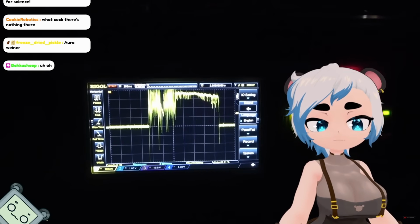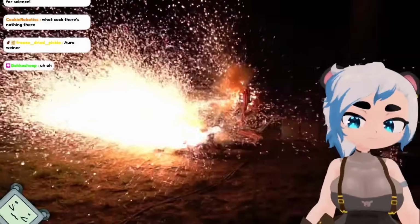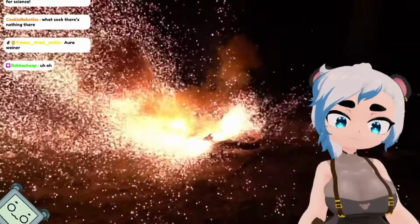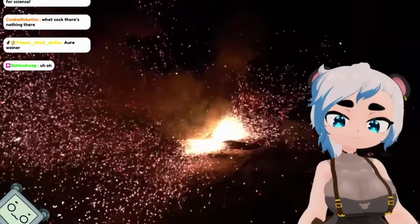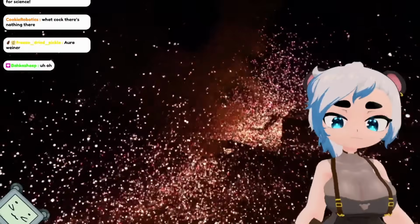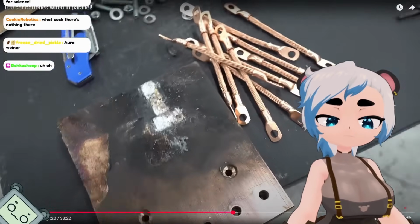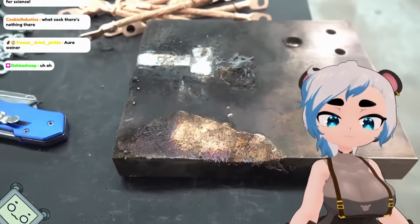That is bonkers. I'm actually glad that the fuses exploded here, because it gives a cross-reference for the currents I'm measuring. The Preece fuse current equation predicts that a bank of 10 6-gauge wires in parallel will last a second at 50,000 amps before exploding. And that's pretty much what I just saw. I'm only surprised how loud it was. I upgraded the fuses to 4-gauge, but at this point the batteries are really being abused. So I'm going to do some other experiments before trying the big bolt again.